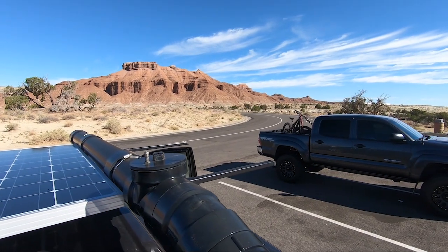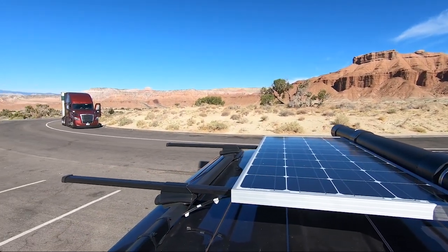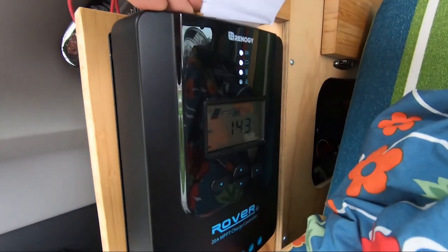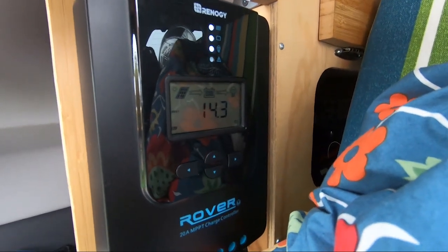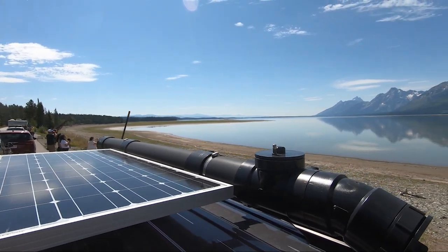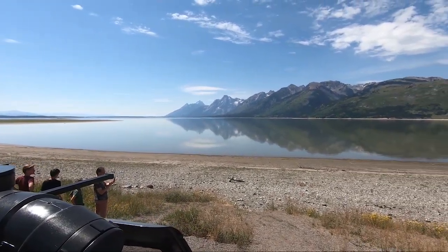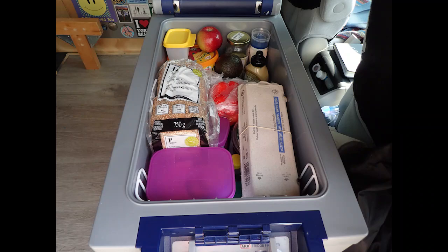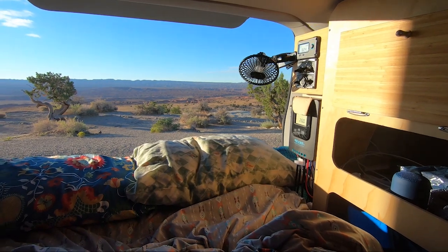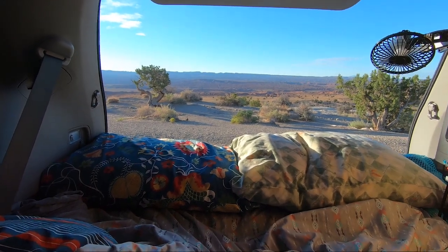Solar panel. Again, there can be only one panel or a solar panel bank, still to be discussed in an upcoming video. The MPPT controller is what controls everything. It's the brain of the whole electric setup. It receives the electricity coming from the solar panel and charges the battery. It also distributes the electricity to all my electric devices in my van: fridge, lights, fans, etc. It would also cut off the supply of power to my battery if there was an electric problem, including overheating of the battery.